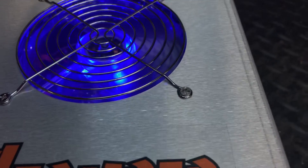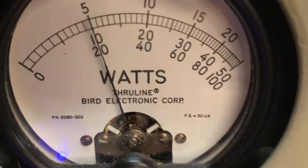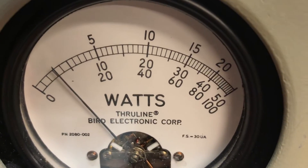I thought 8 watts was high yesterday — I looked at that two times and said that's too high. So 4 watts into 8-pill will achieve 200, and every box can differ. That's why I'm not so much worried about what you key in — I'm worried about when you turn it on and key it up, the final key out. Because every box, every antenna, every wattmeter, every SWR, every radio is just a little different. Right now we're keying 4 watts.